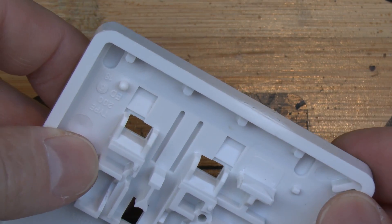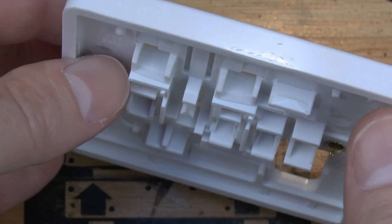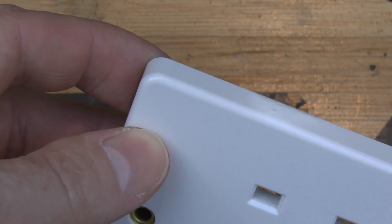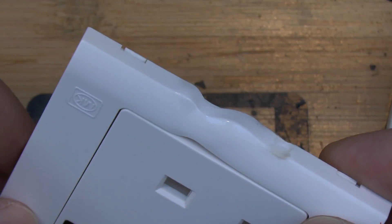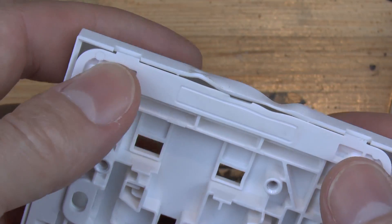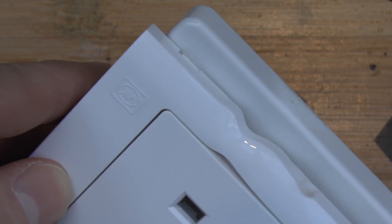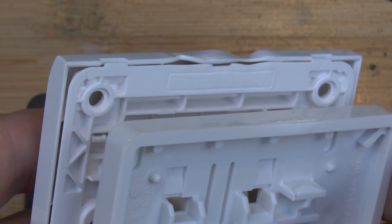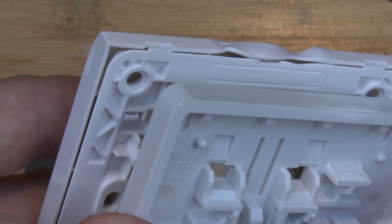Taking a closer look: this is the urea formaldehyde one. There's just a very slight damage on that edge — nothing really significant. Still fully structurally intact. It's just cracked slightly with a little bit of discolouration. That's been in at both temperatures — 10 minutes initially and then 5 minutes at the higher temperature. This one is the thermoplastic polycarbonate. You can see the plastic has definitely softened and deformed, but again it's still relatively minor. In terms of an overheating plug, there may be some discolouration or melting, but it's not going to be dripping on the carpet. Certainly more damage on the thermoplastic, but fairly minor in both cases.